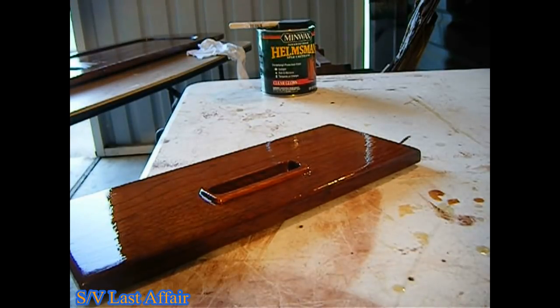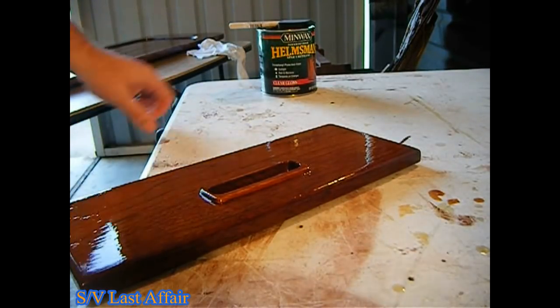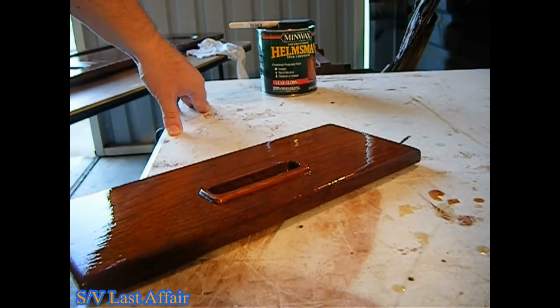There's another drawer face — pretty simple to do. To do these five drawers, this top section, the floor section, two pieces of trim, a small bulkhead wall, a towel rack, and a full-size door into the stateroom — it takes about 30 minutes to come in, lightly sand them, wipe them off with a tack cloth, and apply the finish.